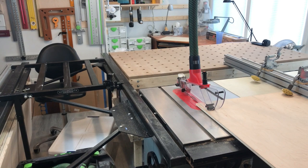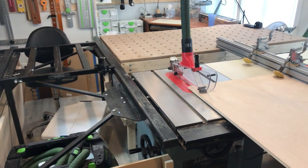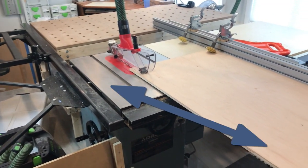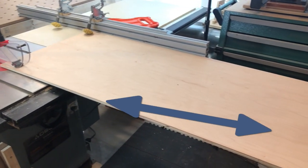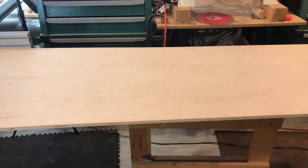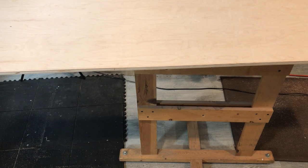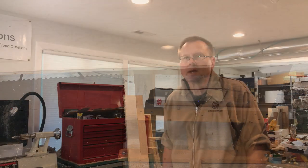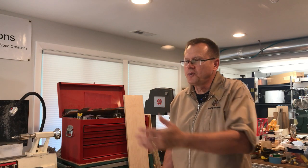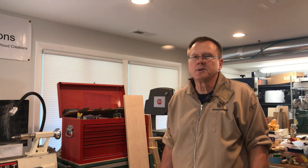In order to rip it, to show the amount of room you need — you need eight feet as part of the outfeed. You have your table saw, and now you have to have all this support and room for the infeed side of the piece. I have a homemade support piece down here. Another concern I have is that I'm so far away from the on-off switch of the table saw in case I needed to turn it off in a hurry.